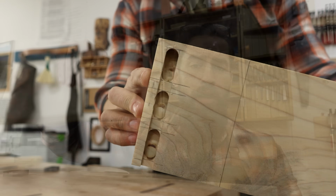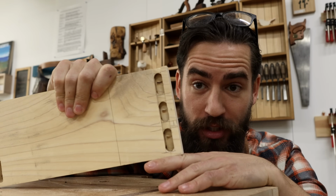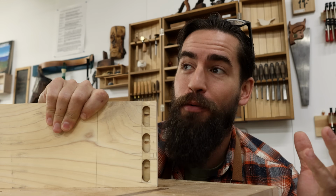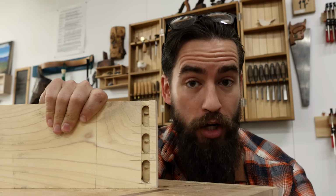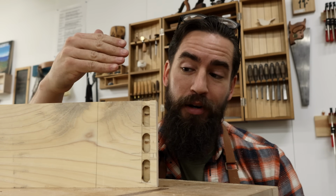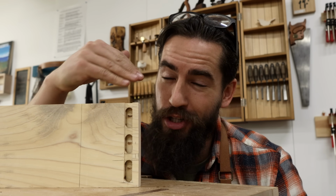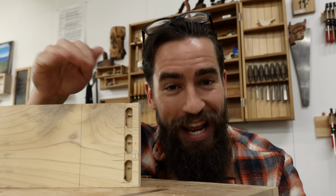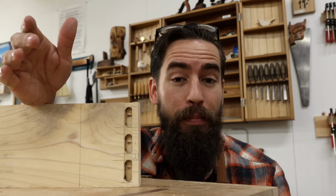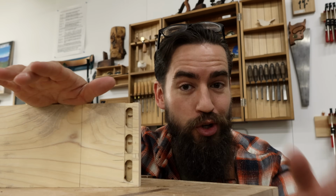And just like that, our mortise is cut. Now, you can see that working to my pencil line is a very accurate way to do it. I can sneak up on it really easily. If I was cutting a dozen, 2 dozen, 100 of these, I would set up stops so that it's more consistent and I don't have to fit every piece to the other. But if this is a corner joint and case and I'm cutting 4 of them, it's gonna probably take me less time to just shave off the ends of those tenons and fit them to the length of that particular mortise than it is to set up a bunch of stops and make this complicated jig. But that's just me. You may enjoy the jig making process and choose to work differently.